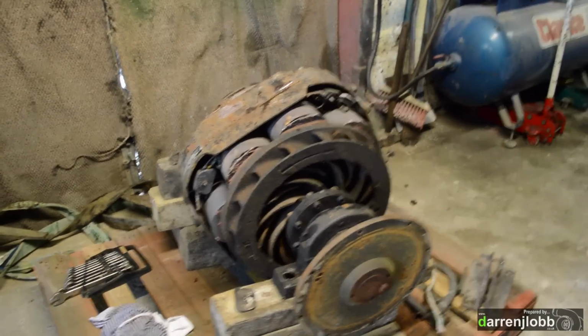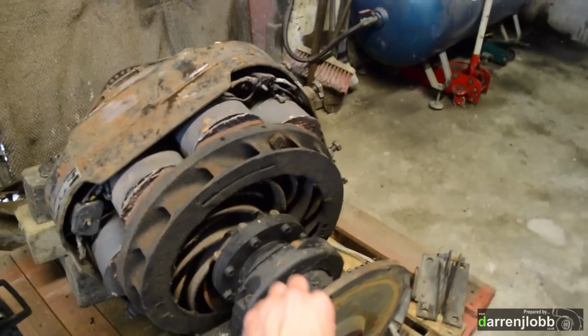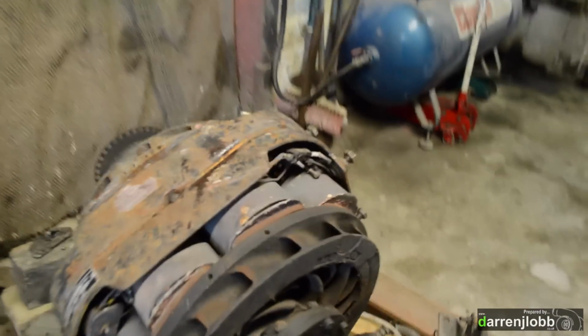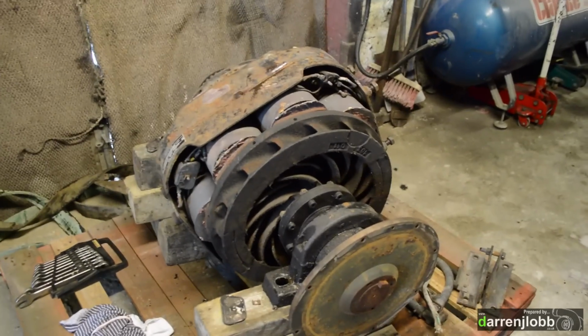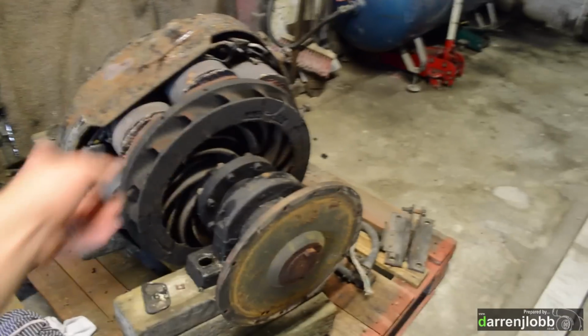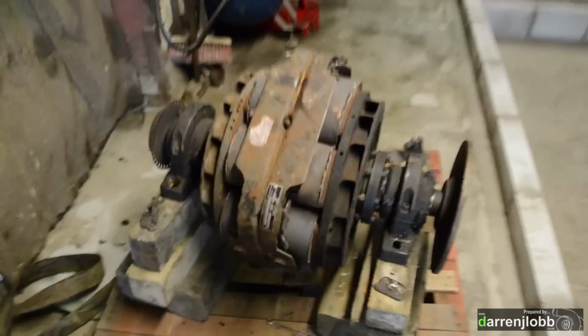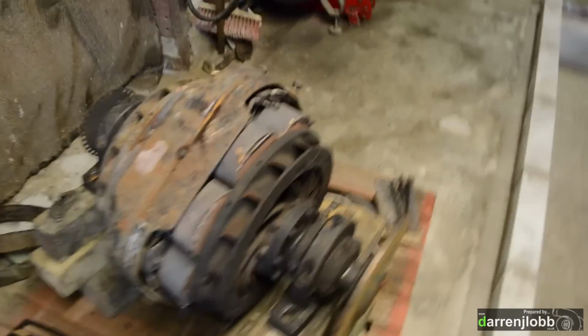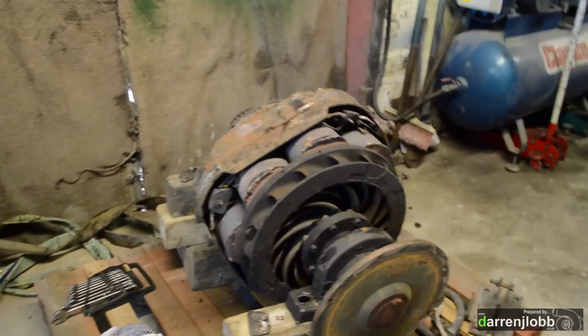So you'll see there's a rotor on each side that spins with the dyno. I should point out at this point, this is actually incredibly heavy in itself. You'll then see there's a series of coils around both sides. These are currently parallel wound. Originally it was used on the old Sun system at 24 volt.